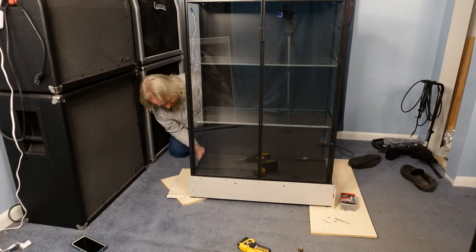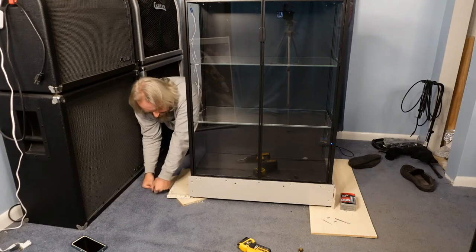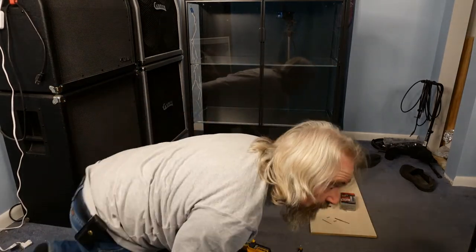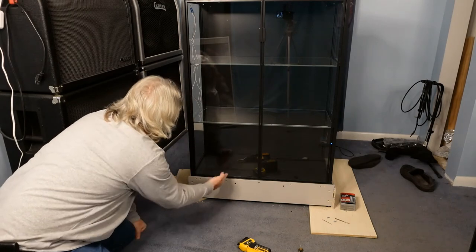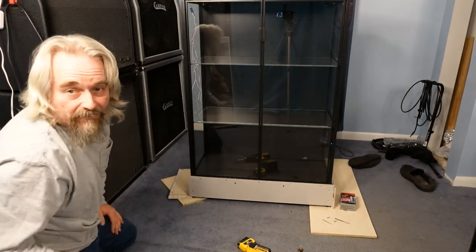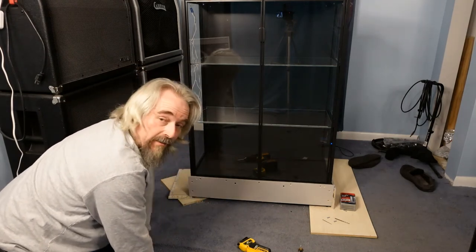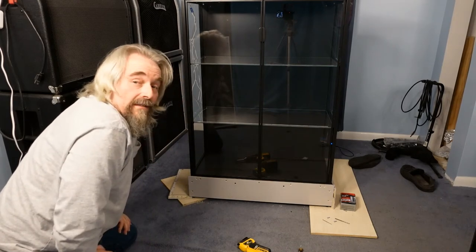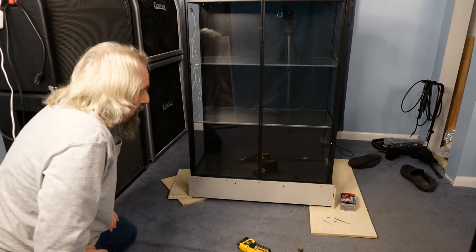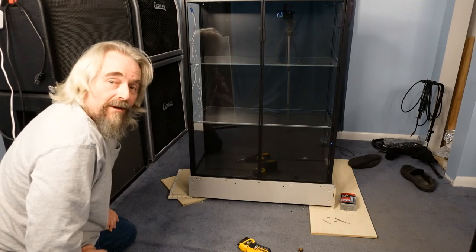Because these legs ain't square. And that's the whole point of doing this, because they'll twist and move. Now, you don't necessarily have to put these on there. You could go and buy a little 45 angle metal and put it here, there, here, and all the way around. You'd need 8. You got 4 legs, you need 2 of them. One going this way, one going that way, and so forth all the way around. So you don't necessarily have to put this. But if you're going to stack, I would definitely heavy up these legs, because I can already see by just putting this wood on that they're already wonky. So we're going to continue with this, and we'll get right back and see where we're at.